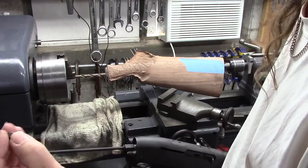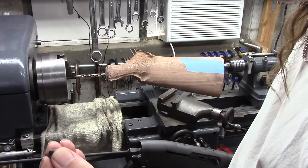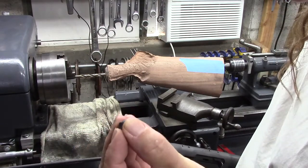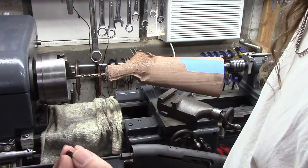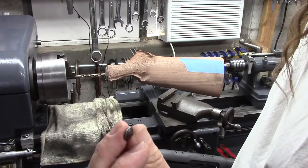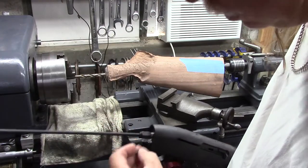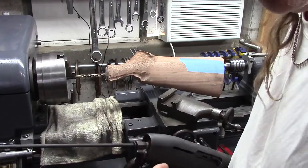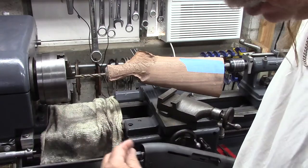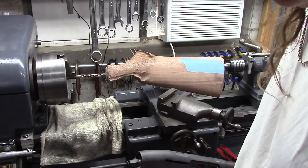So I used an angle grinder with the bolt in the lathe and cut a very shallow point, if you can see it, in the end of the bolt, and then cut it off with a cutoff wheel, leaving only about a thread or two. Then I was able to screw that into the hole and press the stock up against it, and a little rap with a hammer left an indentation.